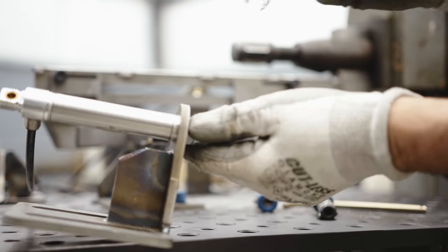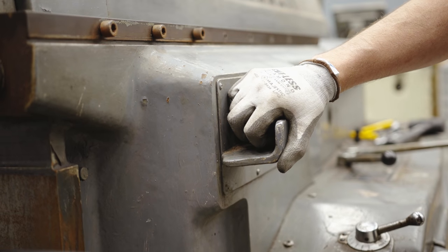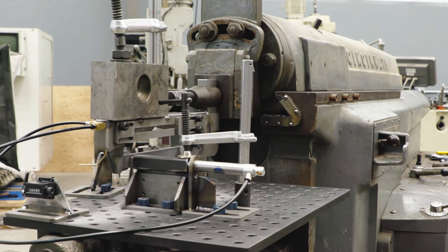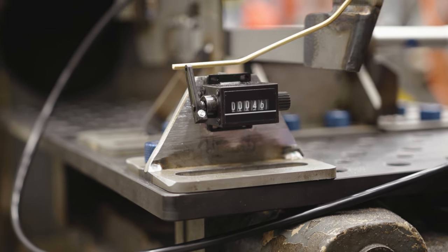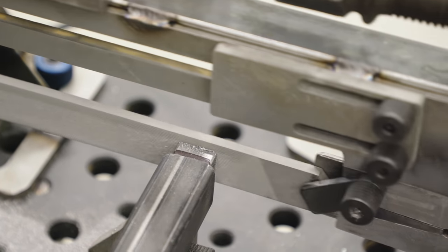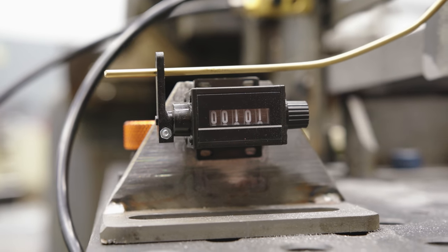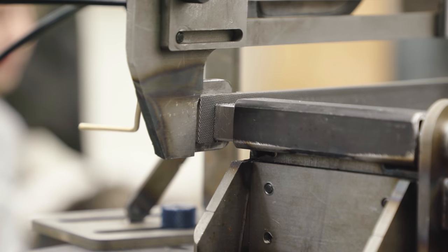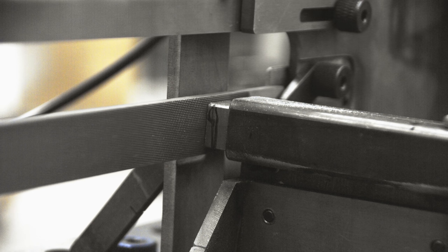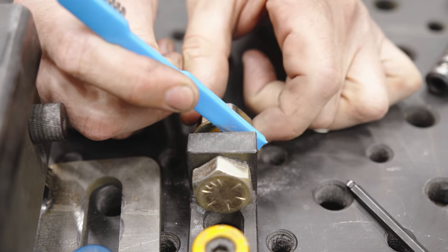With the switch adjusted, that'll stay on the whole time putting constant pressure on the forward and backstroke. We're a few strokes in and I'm already noticing some chips starting to stick to the teeth. I'm also noticing that the chips are getting smaller — there's absolutely no way the file is dull yet, so that only leaves one thing: the chips are actually blocking the teeth from cutting. After 100 strokes, the back drag still is not clearing the file. So right there, that myth is completely busted. This experiment is about file dulling, not file chip removal.